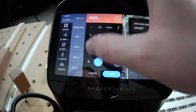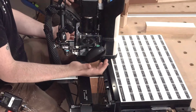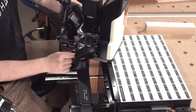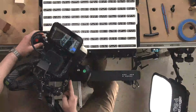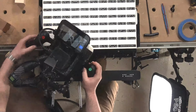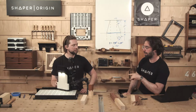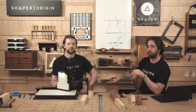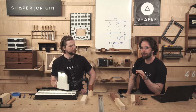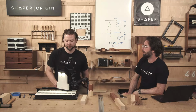The next thing that we're going to be conscious of is I want to make sure the origin is well planted the entire time I'm making this cut. So I'm actually going to cut at just a little bit of an angle, making sure that I'm always on that support bar. We usually say don't do this. We usually say cut straight ahead, but here's a little trade-off. We're going to trade off a little bit of the absolute optimum accuracy of origin for the benefit of making sure that that corner reaches all the way out to the support bar, to make sure that the whole thing is totally stable during this cut, because you see every side of this cut. If there's any little dip or wobble, I think that getting the corner on that support bar is going to give us the best results. Cool.